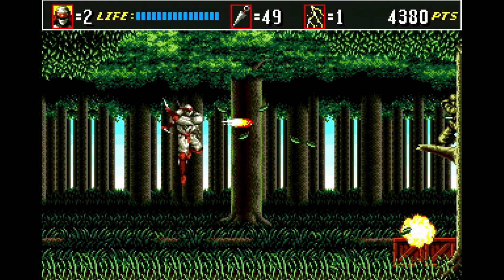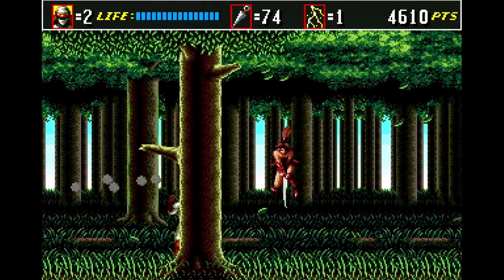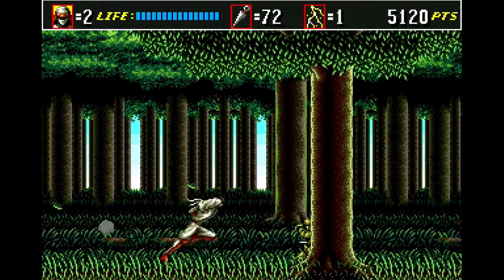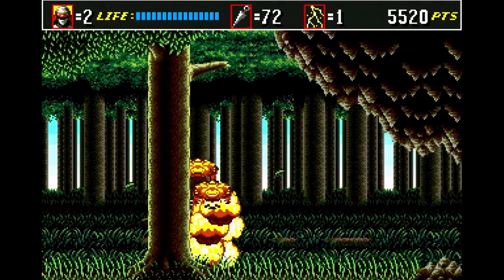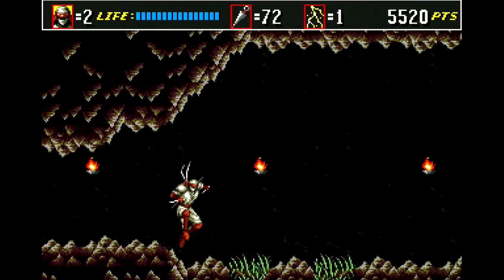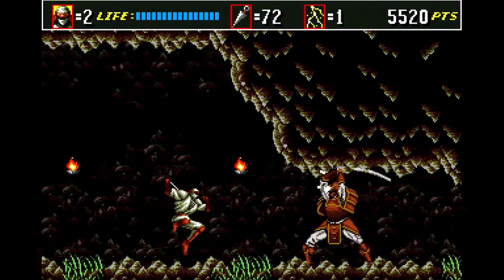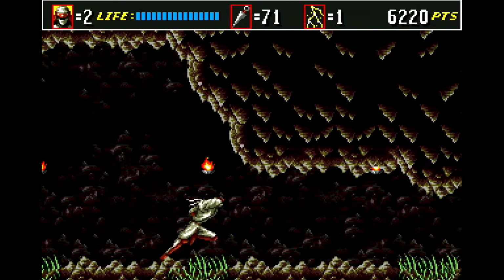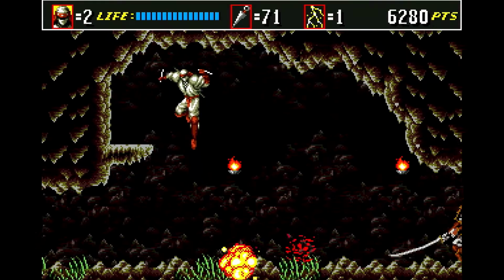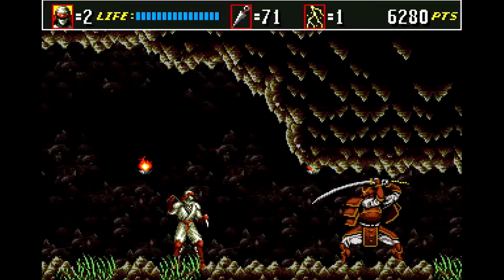In the end, in order to get rid of the jailbars, I had to compromise. I had hoped to retain the functionality of the old DIN, but in order for us to get that good signal, we had to lift those pins. That meant taking the old DIN out of circuit. Now you could desolder that DIN, it's probably a good idea. It would make installing the triple bypass board a little bit easier.